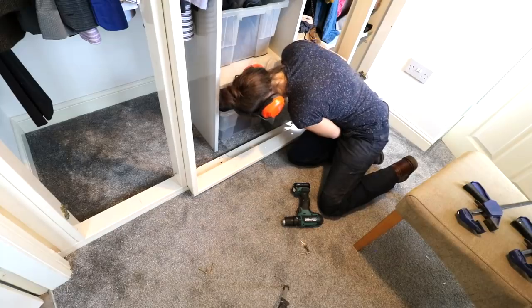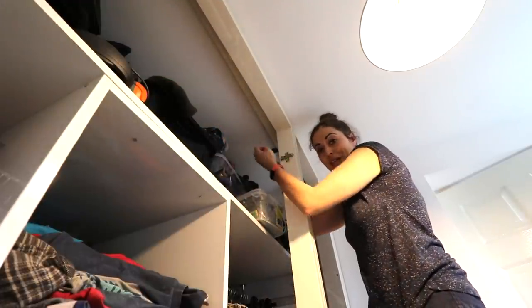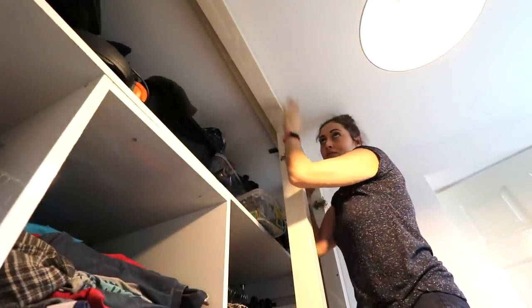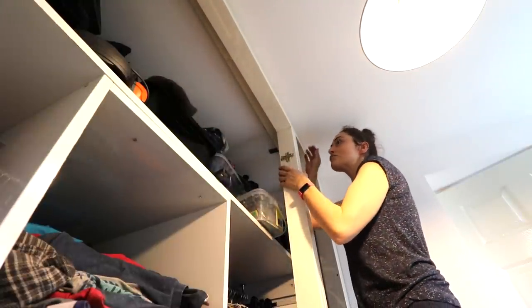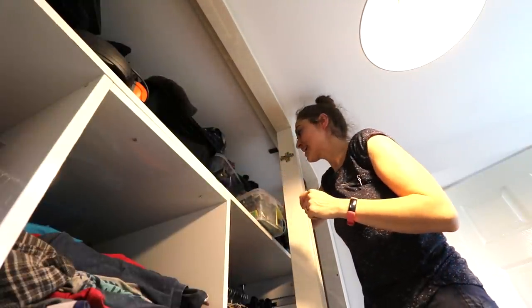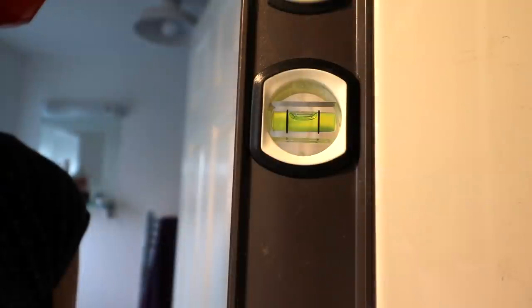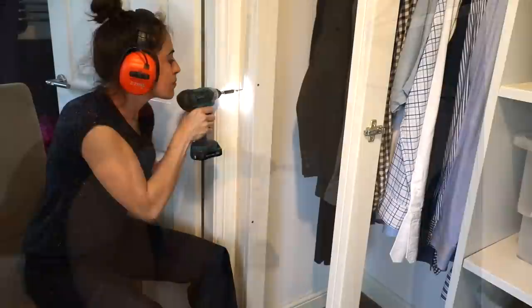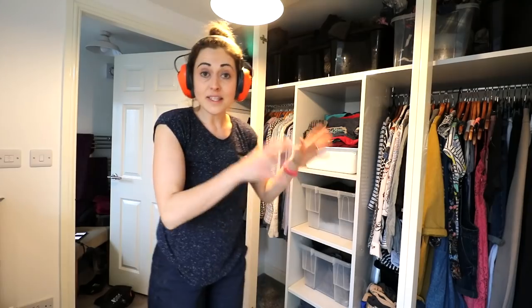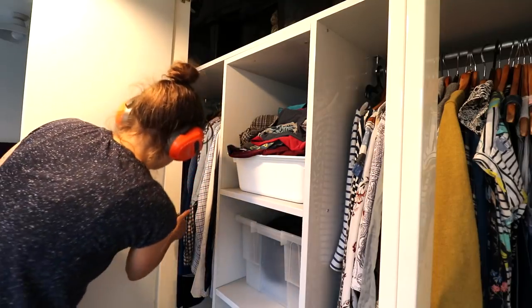Top's on — time to get it all back. I'd had to undo the plasterboard screw to bring it down because there was a gap between the two top pieces and I wasn't happy at all. So I unscrewed that a little bit, pulled it back and tried to pack as many packers in as I could. I nipped it together — that makes me so happy. To mount it more, I pre-drilled the two filler pieces either side and fixed it to the baton behind. Let's get some doors on before I start putting the trims on, just in case I have to alter anything. Prop, and snap them on.